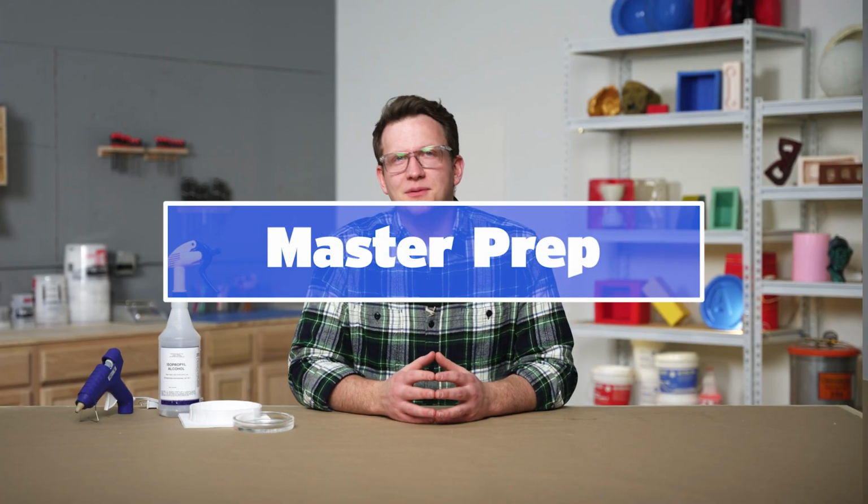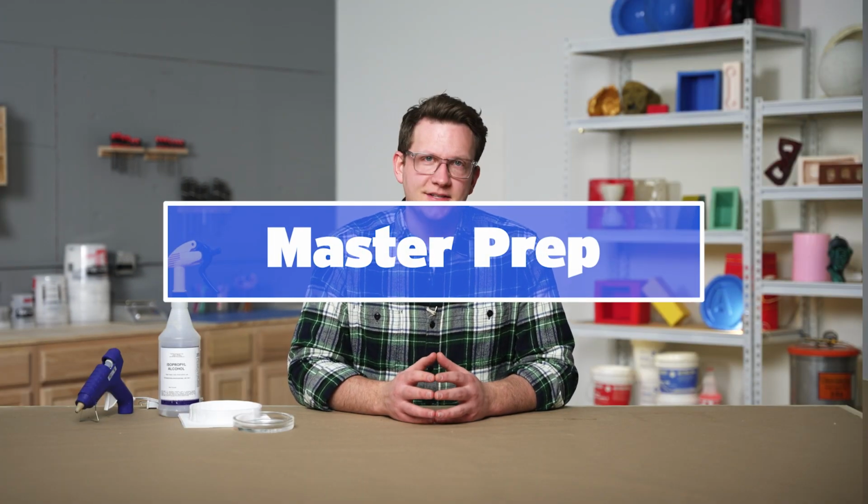With our mold box complete, we're ready to glue in our master. Let's review some important steps and a couple of tips to make sure we set ourselves up for success later on. The first thing we'll need to do is make sure our master is clean. Any debris or dirt on our master will transfer into our silicone mold and become a permanent part of its design. However, it's not just dirt and dust we need to watch out for. Fingerprints, smudges, and other hidden marks will also show up in our silicone mold.